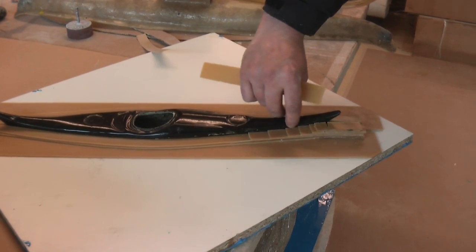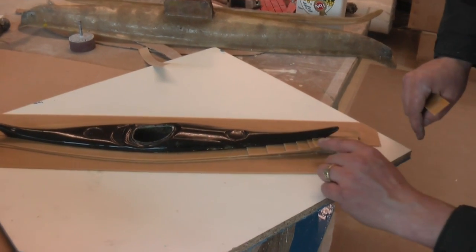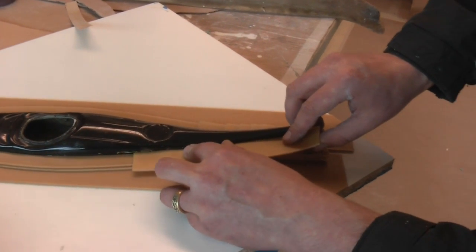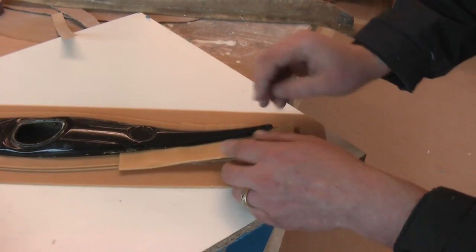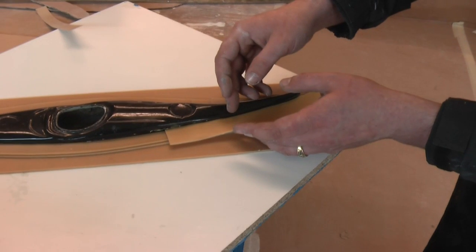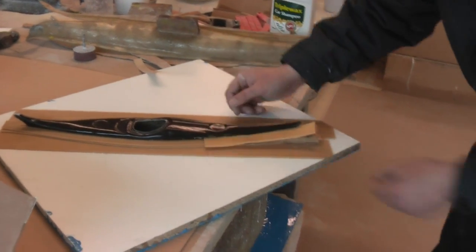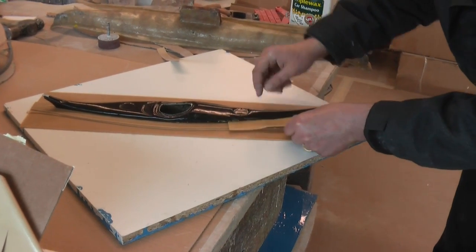As you can see, the split line comes up high because of the shape of the canoe. We've just built that up in steps there. Once we go out slightly quite level, we then take another strip of wax and fix that into place. This is self-adhesive so it should stick. You want to create a flange of around about an inch for a small mould of this size, and you just continue that all the way around the canoe. Once you've got to that stage, check for any little gaps. Fill those up with plasticine or just push the wax further against it — that will stop any gel coat or resin leaking down the sides.